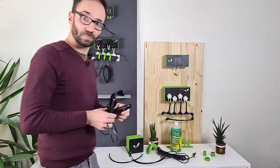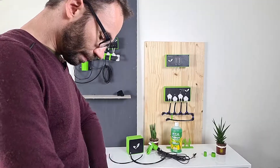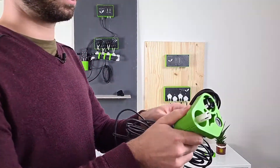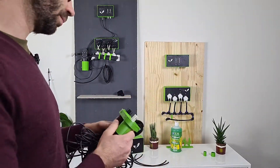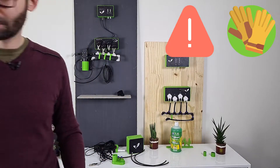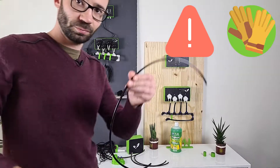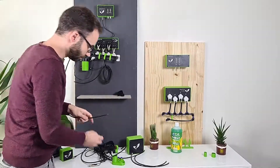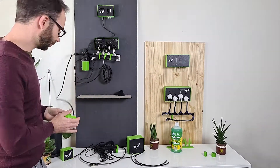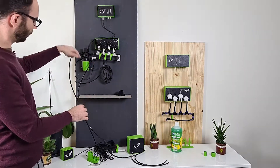Now let's take care of our sensors. We have the pH industrial sensor right here. When it's delivered to you, it will have a transparent cap — take it out and put the green interface cap on the sensor. You should now be able to insert this sensor into the sensor block using a quarter rotation movement. Now you will take the longest tube that was provided in the tube box and cut it in half. The cut must be very clean and 90 degrees so that you avoid any leaks. Please use the proper protection so you don't hurt yourself in the process. You connect the first tube to the mix pump inlet and to the input written on the sensor block — this is a push-release connection. Now you place the second tube on the harness output and plug it to the sensor block output.